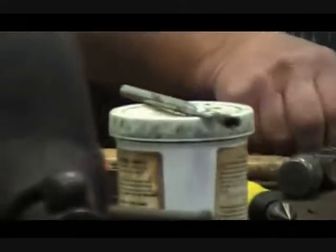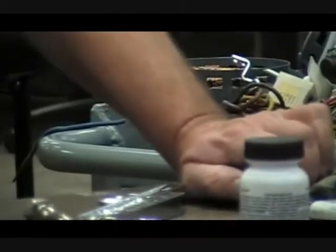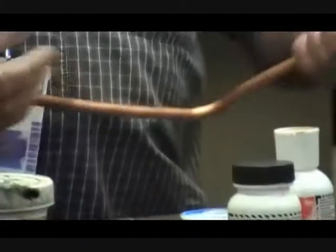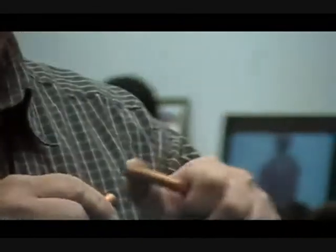Now, I always like to get into the controversial parts. I'm not real fond of this method. I'd rather get a coupling that's already built and use it to attach the two pieces of copper. There's a place for everything. If you've got plenty of room and you have the copper out there where you can freely get to it, this is not a bad deal. The advantage of swaging is how many joints — just one. If you've got a coupling, you've got two joints.